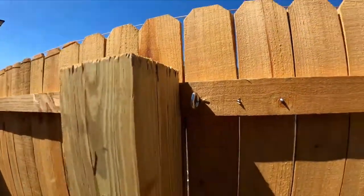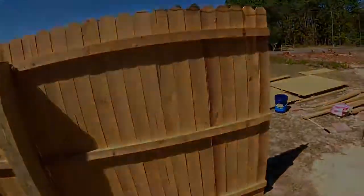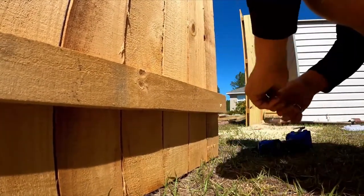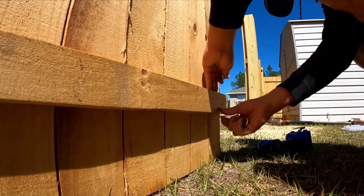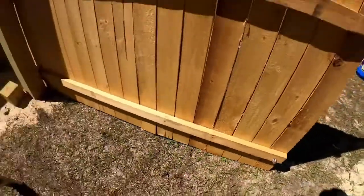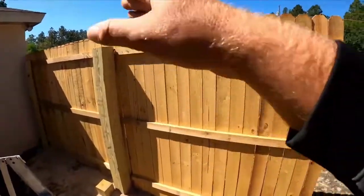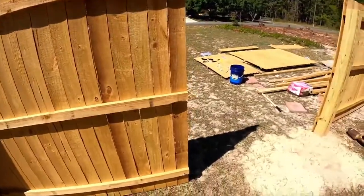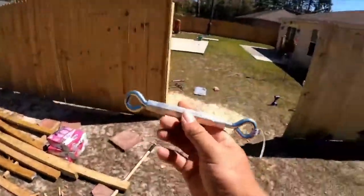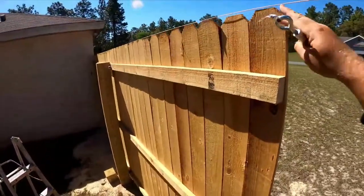And there's our eye bolt. And we'll do a matching one on that corner. That'll be for our anti-sag of the gate. And now we got our eye bolt in each corner. Now we can run our cable and add the middle thing to tighten it. Add our cable and this thing, we can tighten it up. That way we can lift this to be level with the string.